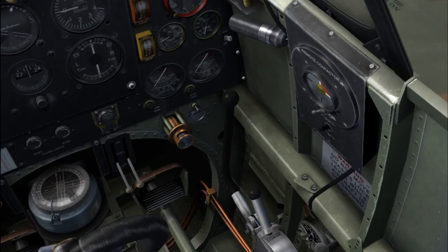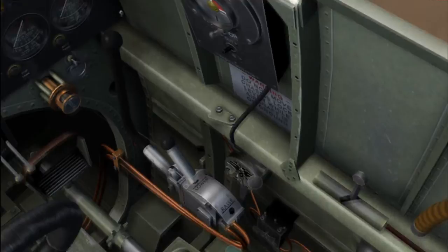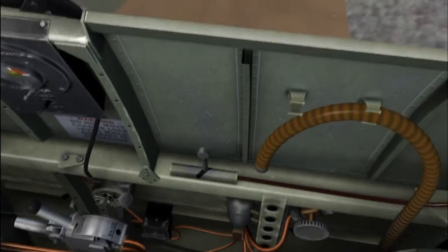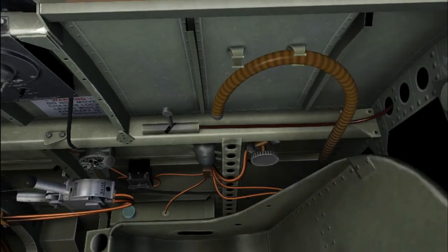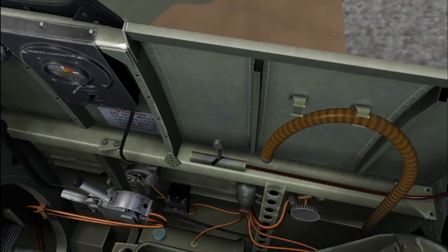This here is our gear pump — the undercarriage is activated by hand pump in the Mk1 Spitfire. Up and down selector, recognition lights, Morse key. DI's on the windshield. That is your harness release. Master oxygen switch — turn it anti-clockwise to open up the flow. This here is the oxygen mask. What you need to notice is that you need to press that and open the master valve for the oxygen flow to work. Once you've done that, you can open up this — because if you don't, the pilot will pass out.